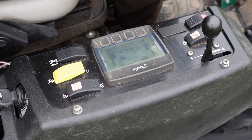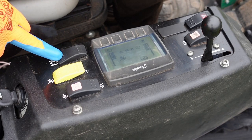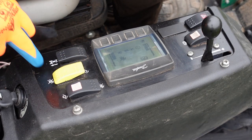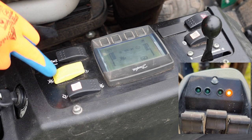These are your hazard warning lights. This is your four-wheel drive in reverse — at the start of the season the ground can be boggy and sometimes you get bogged down and need to reverse. You can press this button to lock up the diffs and get four-wheel drive in reverse so you can get out safely. The all-important button is the cutter button — cutters on and off. When you put the cutters on, a little light lights up on your hand display so you can see they're on.